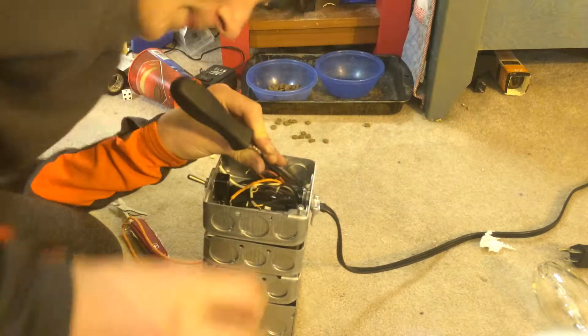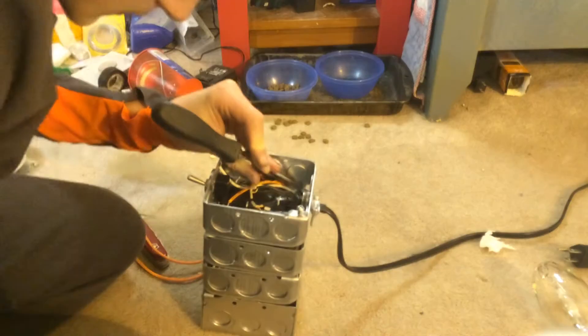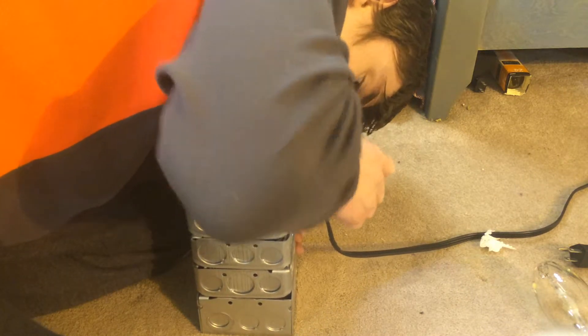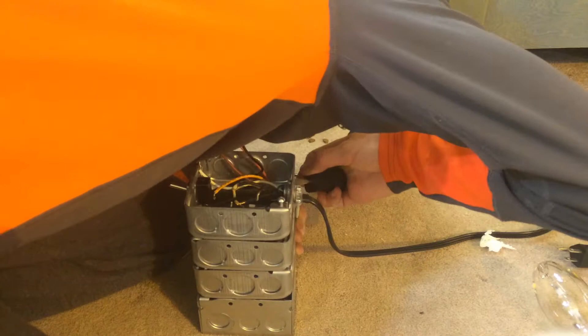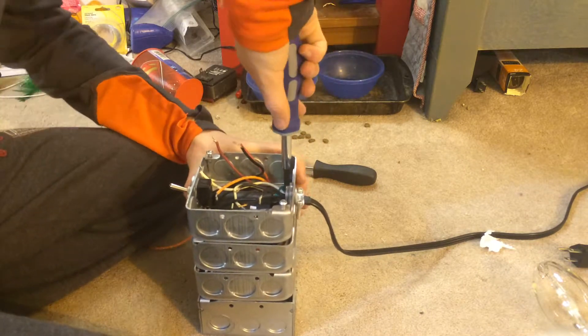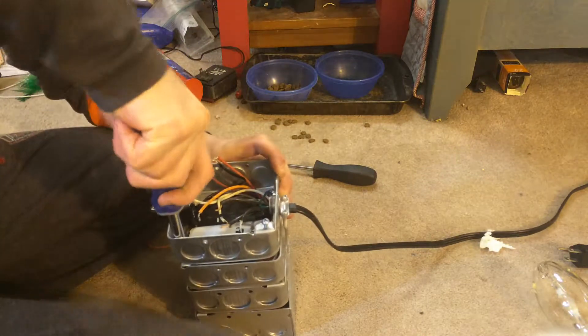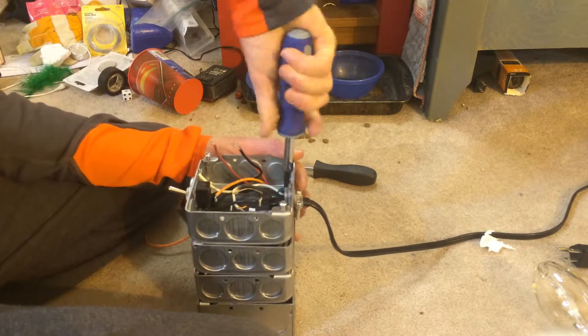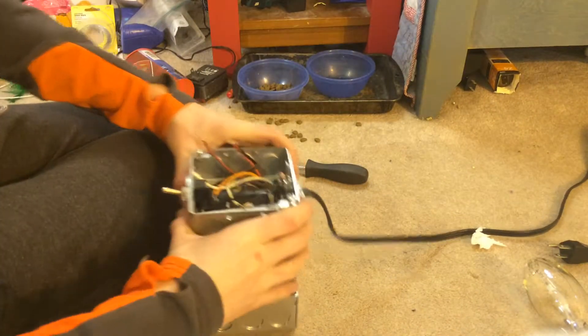You can add a switch if you want — just make sure when you add it the wires are pointing downwards. Now I'm going to put this together. Get the capacitor to stay still — there we go. Now I am going to tighten this screw. This is how I ground it: I ground it to the screw that is closest to where the knockout is. Put the wire around the screw and tighten it while holding that wire in place so it won't peek out the side. Make sure it stays in there and close this up. So it's tight and solid.